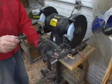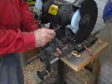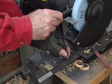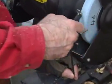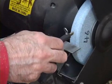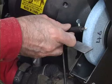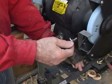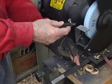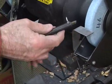We take it over to the grinder. Looking at the Wolverine jig arm, I've drilled a little eighth-inch hole in the corner of the jig — this becomes my pivot point so that the angle is correct to use the jig just like it would be on a bowl gouge to dress the bevel lightly. The whole idea of a jig is to return to the exact same repeatable angle, and we don't have to get our fingers so close. With the Jordan jig — which John has allowed me to sell with him, and we both have them in our catalogs — it saves tool life and you don't have to get your fingers so close doing it by hand.